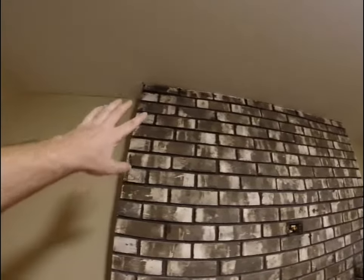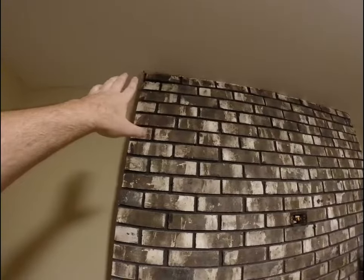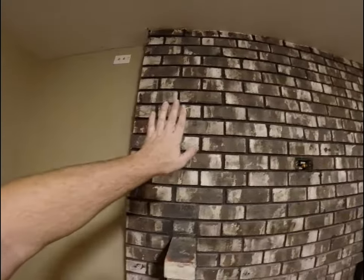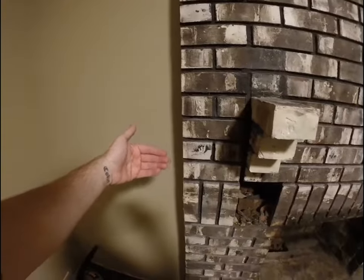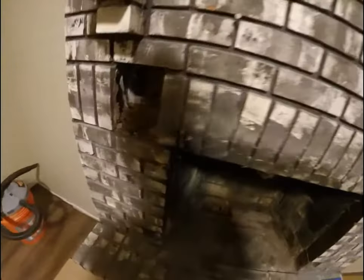When we take these things down we're probably going to cause some kind of issue up there. The idea is if I build the plywood out to at least there, I don't have to worry about what's going on up there. We can take the stone right up to the drywall or a little bit out — that's fine. The bookcases we're building out here will be at least 10 or 12 inches out anyway, so we should be good.